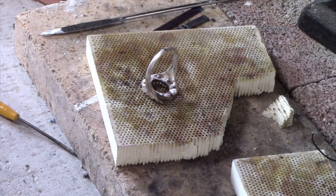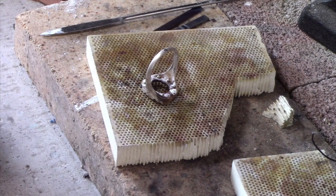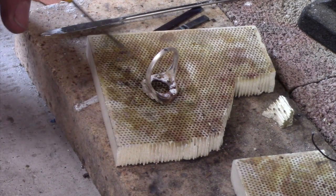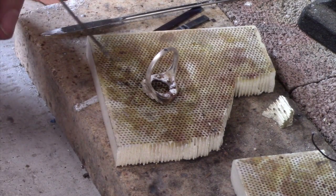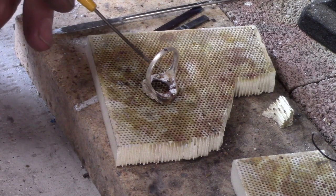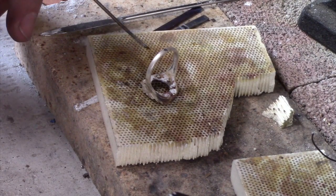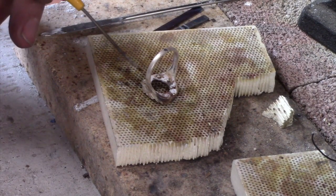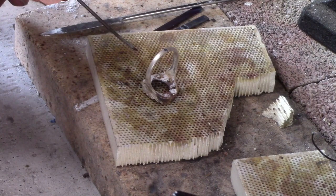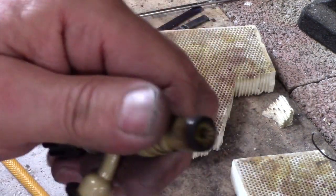Okay, this is really nothing more than just being fiddly about it. And I think I probably picked this up from somebody on YouTube, so I can't claim any credit for it. But I really like to make balls of solder when I'm doing an operation like this, because that solder is going to need to be in contact with both surfaces, and that angle is pretty sharp. And so using balls of solder seems to improve my success, at least, with this. So I don't know if I've used enough solder. We're going to find out together.